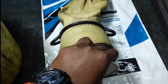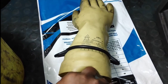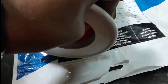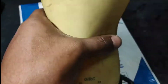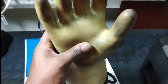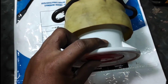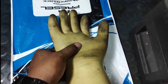Just start pumping the pump — like a balloon, that's it. Just pump it. You can see air flowing inside the gloves. Right now the gloves are full of air. Just leave it for 10 to 15 minutes. If the gloves become loose again, that means there is some leakage, and the gloves are not safe to use — just throw them away.